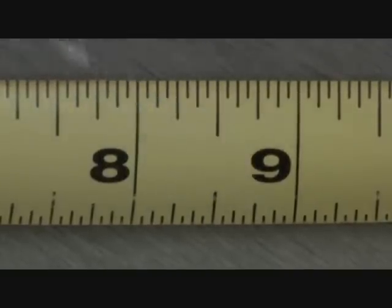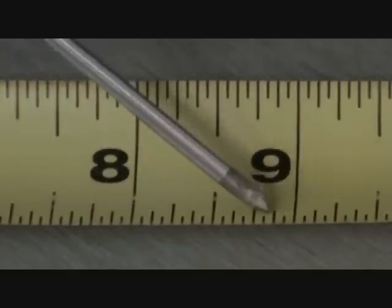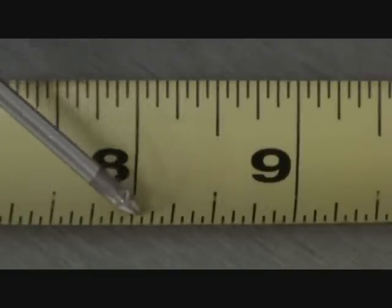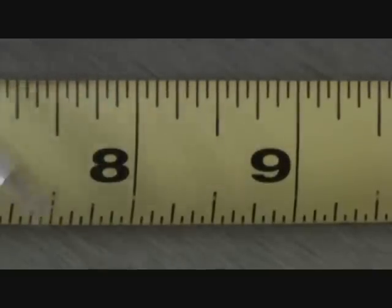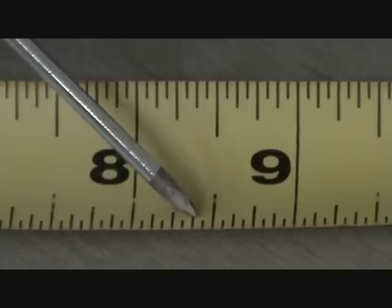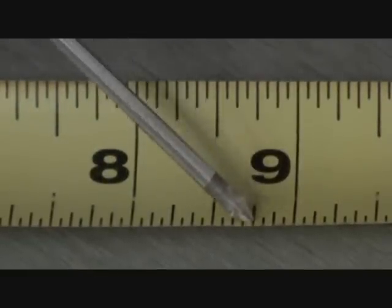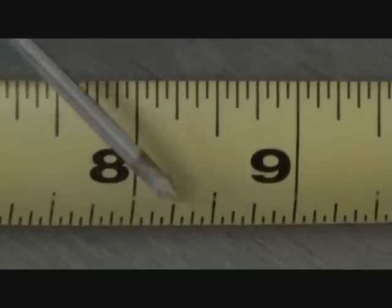So right there, eight and three-quarters. And that's eight and seven-eighths. The eighths — seven-eighths, because eight-eighths is an inch. Four-quarters is an inch. Sixteen-sixteenths is an inch. Do you see how that breaks down? So here's one-eighth. Two-eighths is a quarter. Three-eighths is just three-eighths. Four-eighths is a half-inch. Five-eighths, you would say five-eighths. Six-eighths, you wouldn't say six-eighths — you'd say three-quarters. Seven-eighths, you'd say seven-eighths.